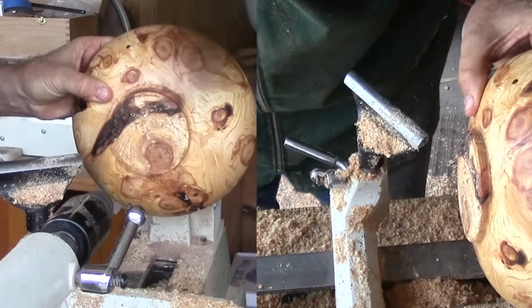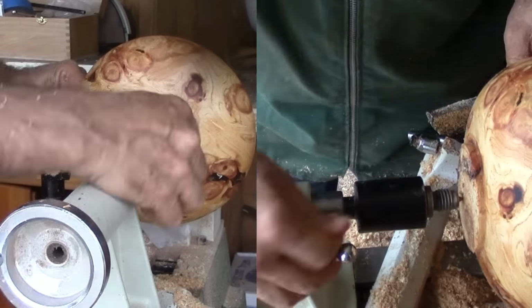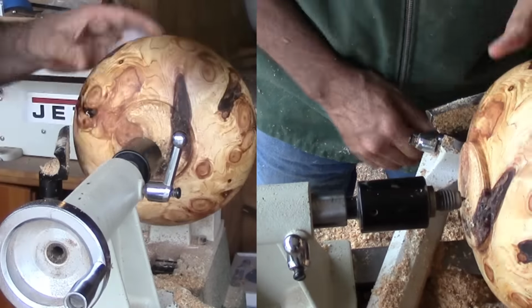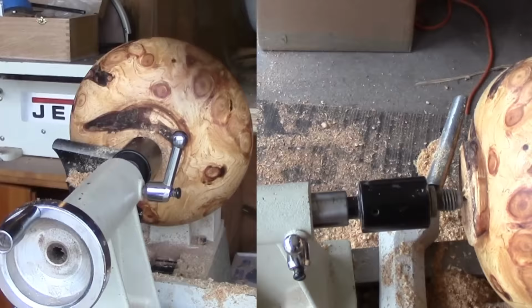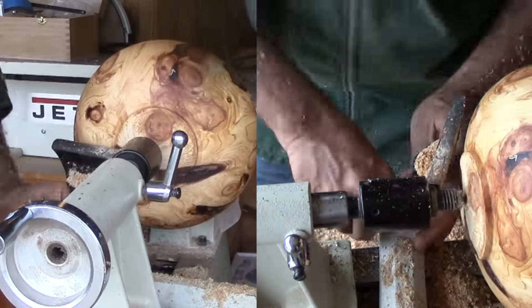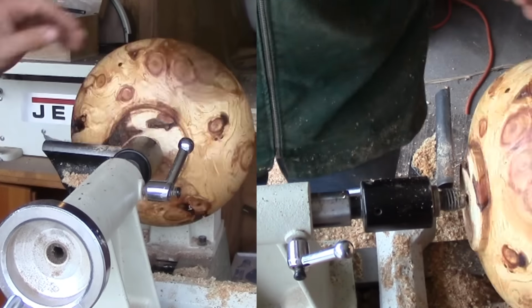Now for the foot. Cole jaws, buried somewhere, to surprise me later. What can I use? How about some packing foam salvaged from the move? I'll fold it several times and use it to pad the chuck. The tailstock will maintain pressure against the chuck. The problem is aligning it to center.